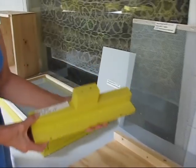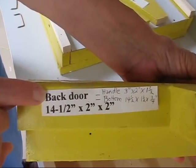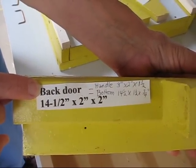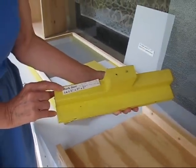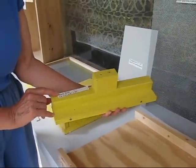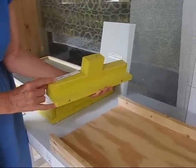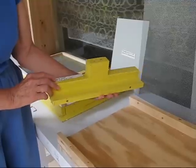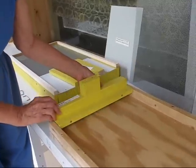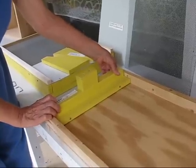Next step is the back door: 14 and a half inches long by two inches by two inches. With the bottom, 14 and a half by one and a half inch by three-fourths inch thick. With a handle, three inches by two inches by one and a half inch. Placed on the back of the board.